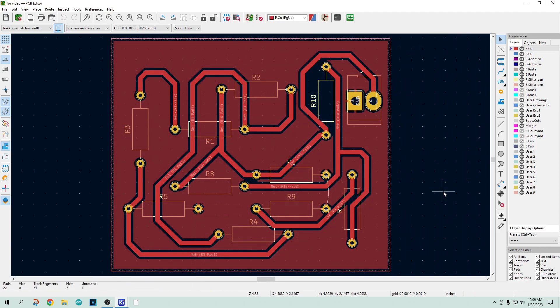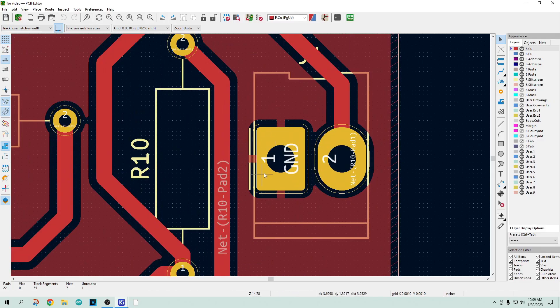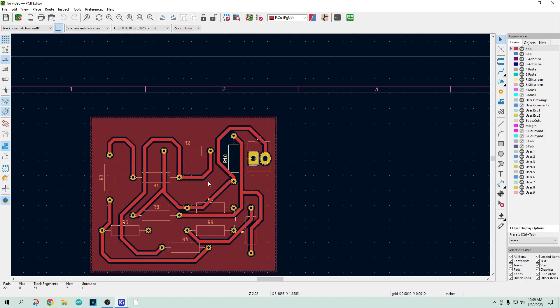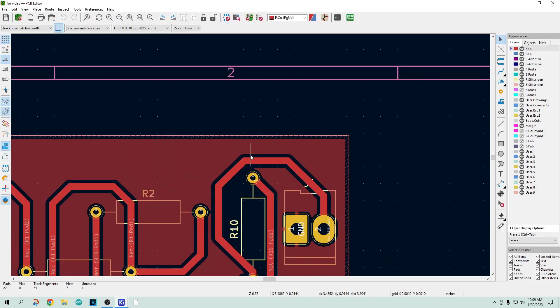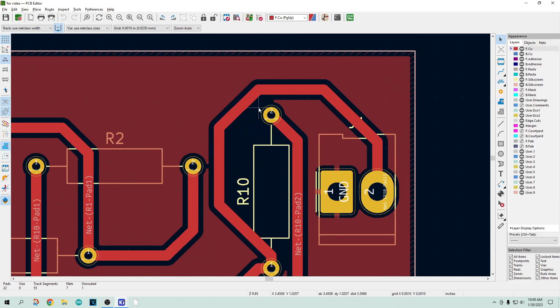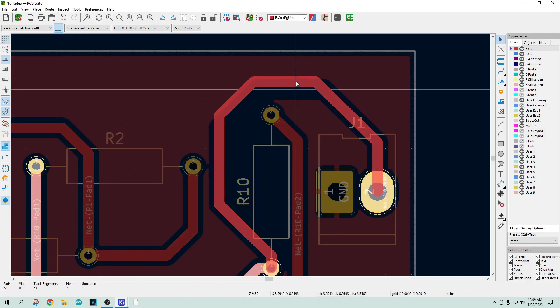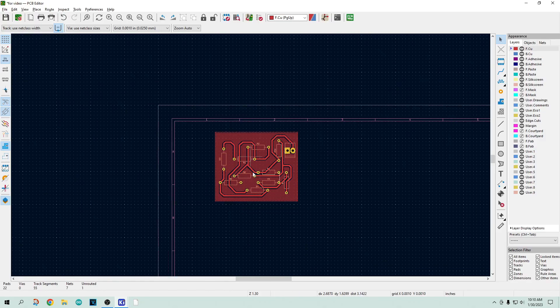I've created a fictitious board with some objects that will cause problems if you don't know they exist. It's just a bunch of resistors connected in funny ways — a do-nothing circuit that gets the point across. We're using copper pour here, and the ground connection goes through a connector into the ground plane, which distributes the ground. The first problem: there's a missing copper fill right here because there just wasn't enough room for the copper to fit through — not enough clearance per the design rules. We can fix that by moving this component over a bit and re-filling.